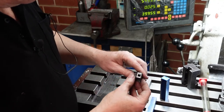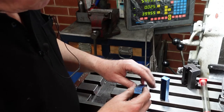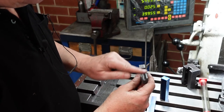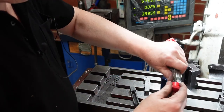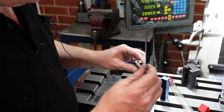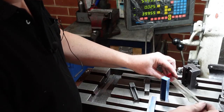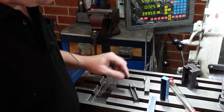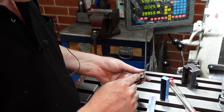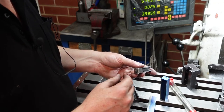It doesn't need to be halfway — this one's actually a little bit lower than that, probably because of the size grub screws I had. Now I made these in a difficult way in that I drilled a hole through there before I machined that off so I could use a square broach to put that square hole in. If you've got a square broach this is actually the easiest way to get a nice square hole, but if you're lacking a square broach you'll have to form that square hole with a round hole and needle file in the corners. It shouldn't take too long because it's only a short hole.